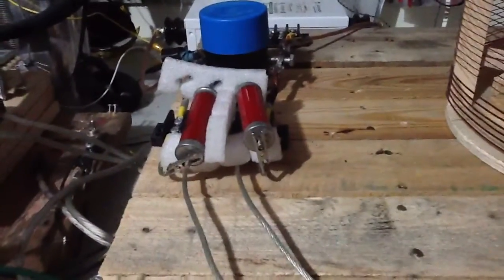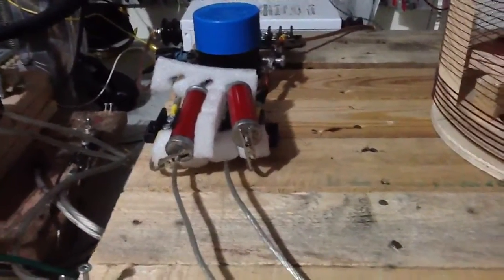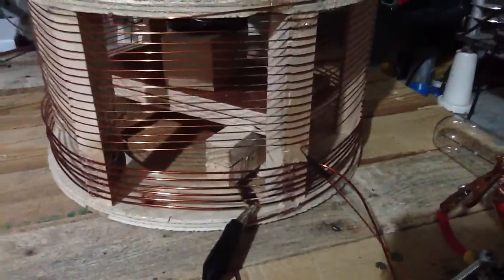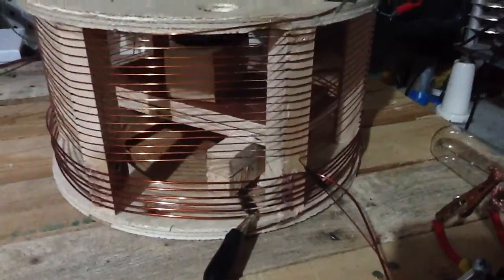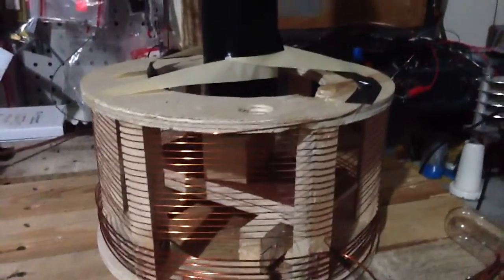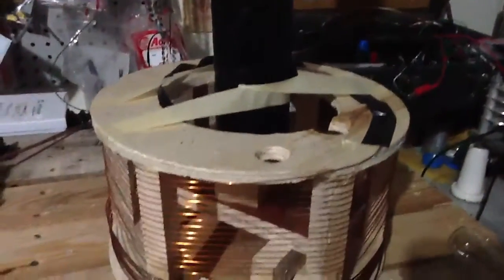So here we've got a primary coil with adjustable inductance. I've got 2.5 nanos across that coil, and it's approximately 17 turns secondary. Now between the secondary and the extra coil and the mast capacitance is what the resonance is.